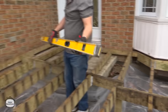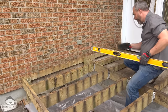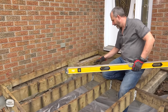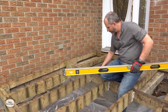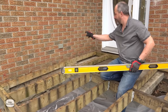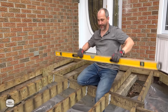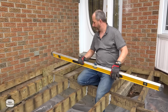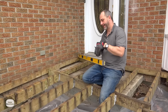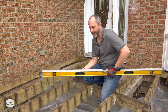It's okay to build on top of your concrete step and use that as structure. What's not okay is to attach a rim joist to it and use that as your hanging lumber for the next piece of joist — this corner is only attached to two screws on a 2x4 and a couple of screws to a sinking 4x4 post. As that post drops, the entire deck drops with it. The butt end up here starts to stick up, screws come loose, everything starts to rot — absolute mess, and nothing is ever square.